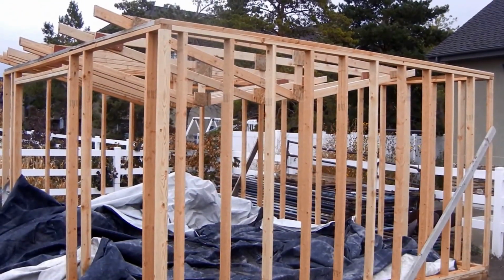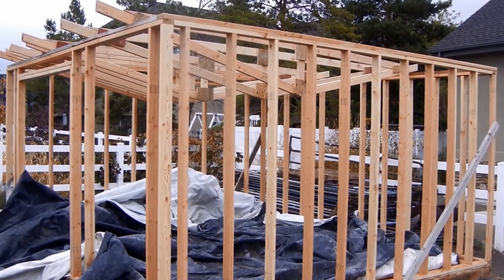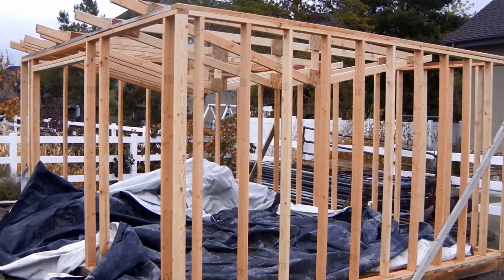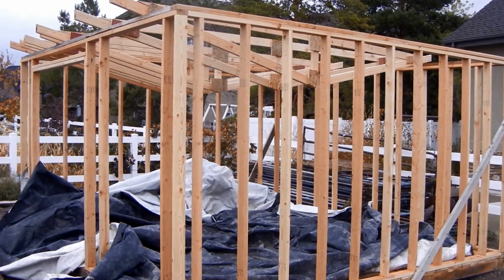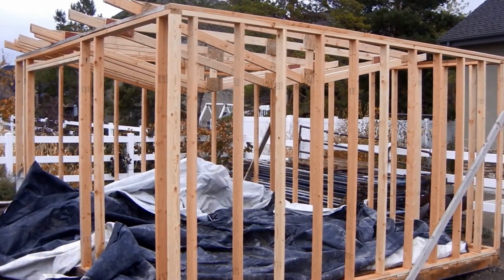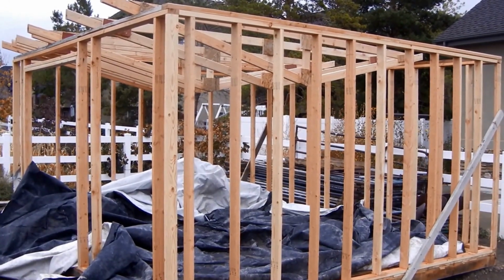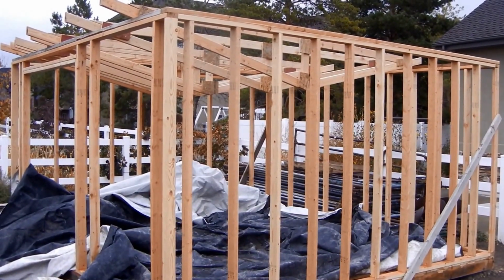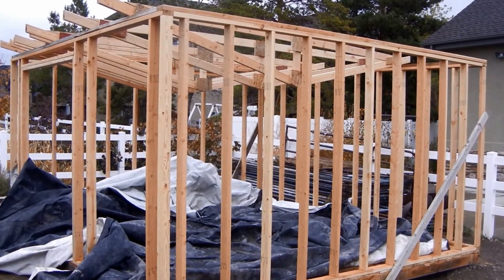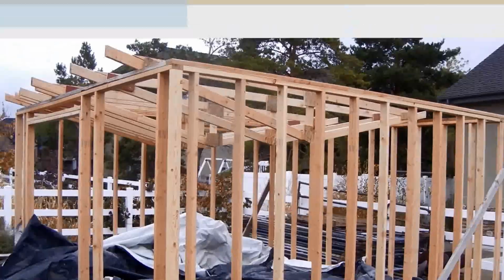Alright, here's an update on the shed. I just brought all the rafters out. I hung them up in there upside down. I'm going to orient them and put them on 2-foot centers. Mistake I made is I didn't go up and mark the top plate on 2-foot centers before I put them all up there. So I'll have to slide the tape underneath and mark it. I think I'm going to put a few pieces of siding up to shore this thing up, square it up, keep it from wiggling before I start climbing on it.